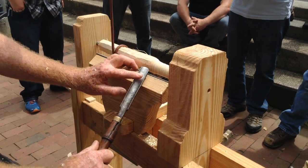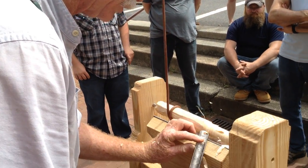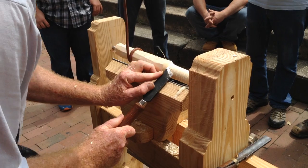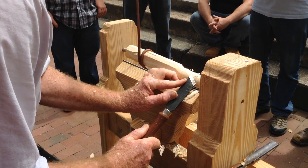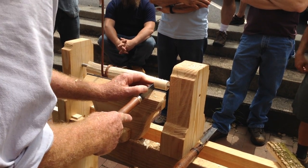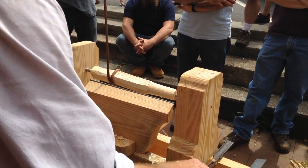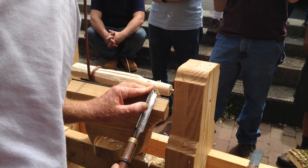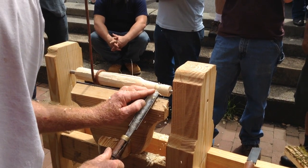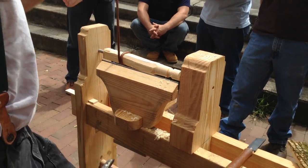See, now it's happening, isn't it? So again, once you get it all cylindrical, you start your pattern work and use things like the skew chisel to pare it down. You can strike in your patterns and turn the hollows and rounds and so forth that make decorative turning — always cutting from the big diameter down to the small. You're always going downhill.